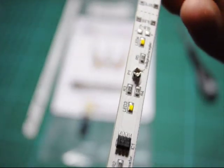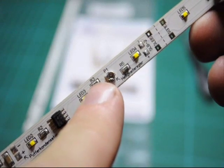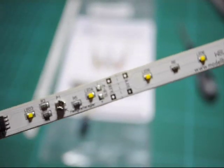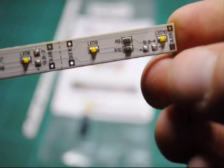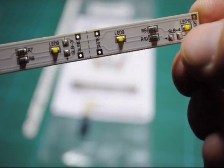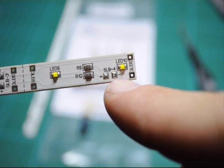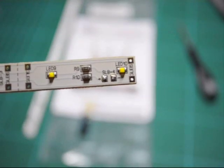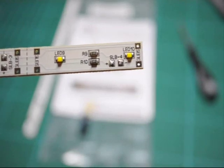When the board is one piece, you can see this P1 — that is the screw that you turn to adjust the brightness. So this is the whole board. You can see the LEDs and all the resistors built in. On the end of it, where my thumb is, it says SLB4. There's a plus mark and a minus mark there. Say you had a coach with tail lights — you could power those LEDs or little bulbs from those two solder pads. Very useful.